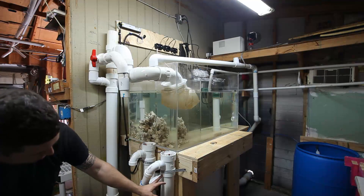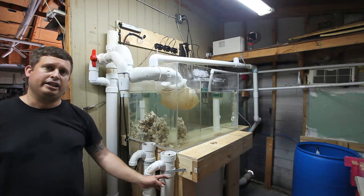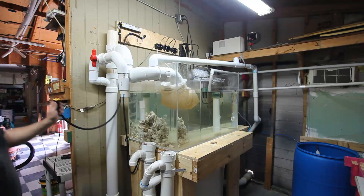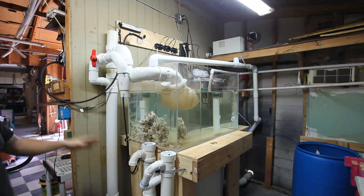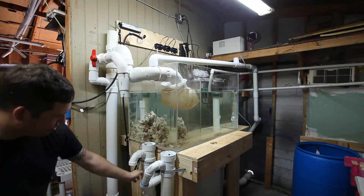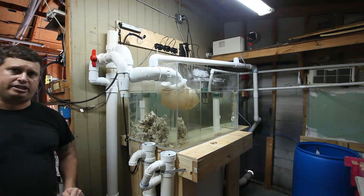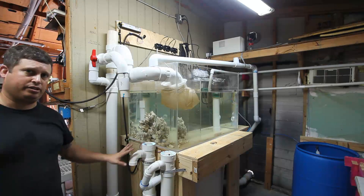There are two indicators built out of a glass rod that have been siliconed in — I talk about this in part one. While you shouldn't look directly at the bulb for any length of time, you can see here that there is light and you can see the indicators here. So if water was flowing through here it would be sterilized by the time it came back out. It's 36 watts and 36 watts, so there's 72 watts of exposure.